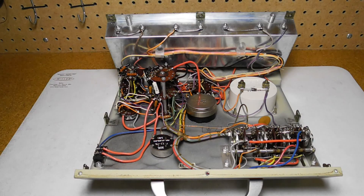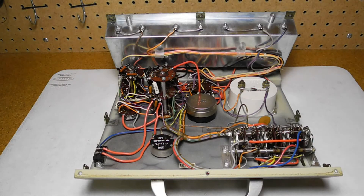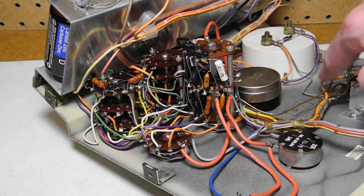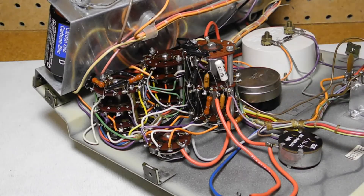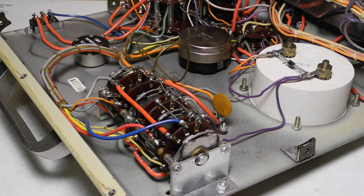Taking a look inside, it uses all point-to-point wiring, with construction simplified by using factory-assembled wiring harnesses. While the manual says you can build, test, and use this instrument in a few hours, there would have been a significant amount of assembly work. The resistors are mounted on rotary switches, and most are 1% tolerance values. The meter shunt for the 15-amp range is a 0.01-ohm resistor made from a piece of wire. The meter has protection diodes across it. The gain and bias controls are wire-wound potentiometers. There are two capacitors across the transistor socket and banana jacks, presumably to prevent possible oscillation of the transistor.